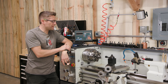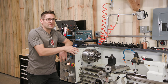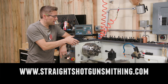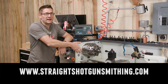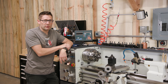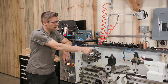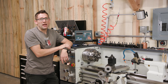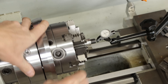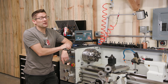The lathe I'm using here is the Precision Matthews PM1440 GT, and I'm using a new work holding system called the Truebore Alignment System from Straight Shot Gunsmithing. This allows you to dial in barrels both radially and axially and brings some new capabilities that I'm pretty excited about. I ran a dial test indicator on the grooves and got things running nice and true, and that means we're ready to send the neck-only reamer down the muzzle to do that counterboring.